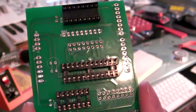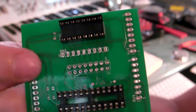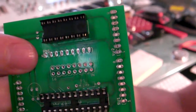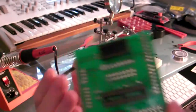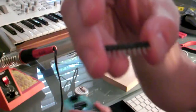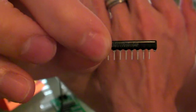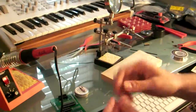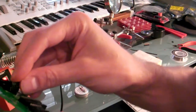Okay, so I've clipped off that extra pin, and one of the things I noticed on the board here that's nice is it'll actually tell you over here that pin 1 goes in here, so you know which way to put the resistor network around. Again, the missing pin on the end here — hopefully you can see that there's a side that has the lettering on — so it's the one furthest to the right that's been clipped off, and based on where pin 1 is on the board, that means this will go in this way.